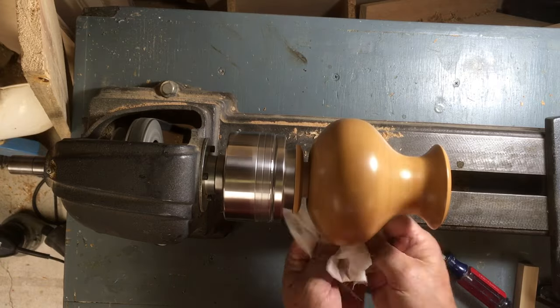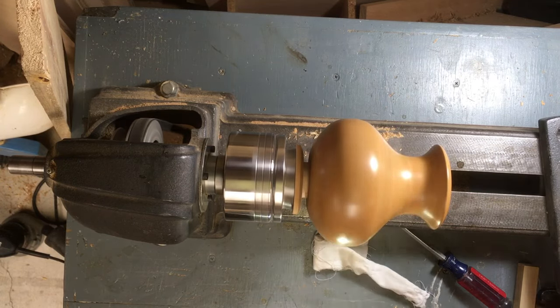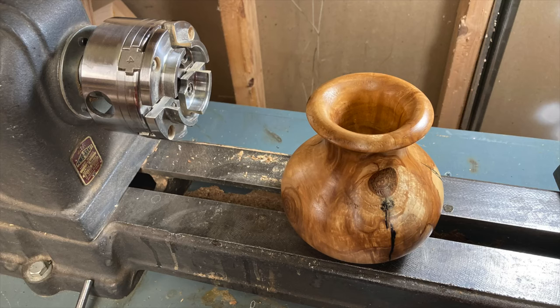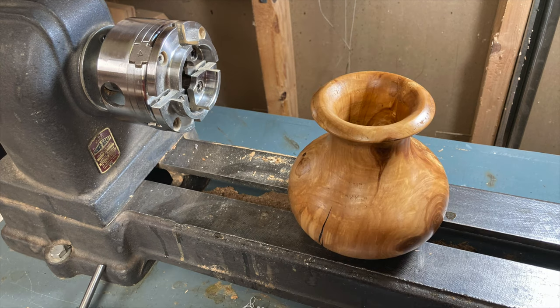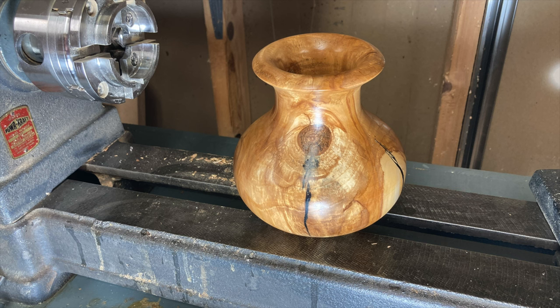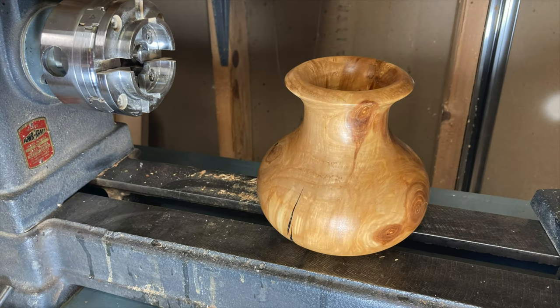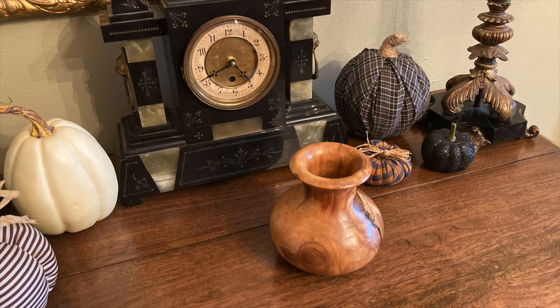So the finish is basically three coats of shellac and one coat of paste wax. Here are different views of different sides — I think it turned out pretty nice. This is the first time I've ever used lilac; I honestly didn't even know it existed as a wood, but it's a good-looking wood. The crotch helped with so much going on with knots, cracks, and different grain types, and it turned out to be a pretty nice looking little pot.